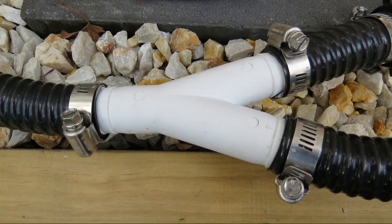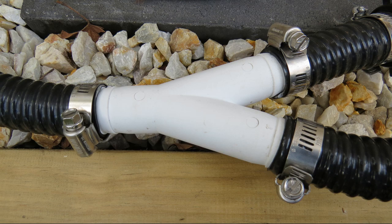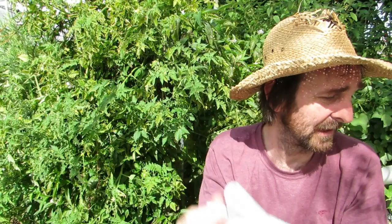These were easy enough to fit - I've just pushed them through the pipe and used stainless steel 316 hose clamps. Finally got around to doing it today. I haven't fired it back up yet - we'll wait and see what it looks like. But I'm taking the time while the pumps are all turned off to clean out the radial flow filter.